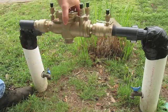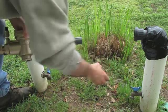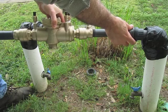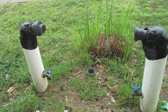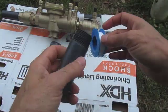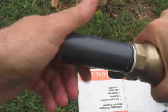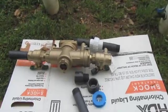So the goal is to cut these ends so they match up as close as possible without overlapping. Also, be sure to use plumber's tape on any threaded connection - don't cement it, just thread it and use plumber's tape. You can see a little bit of plumber's tape right there on this end. That'll help reduce leaks. The next shot I hope is the final assembly.